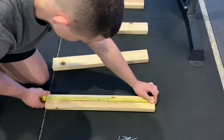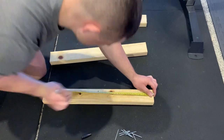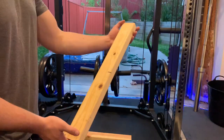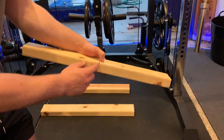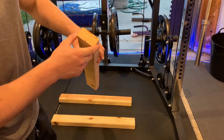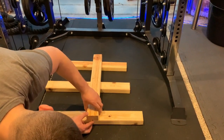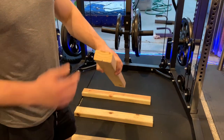So 60cm, so it'll be 30 in the middle. The way I'm marking out the middle — this is a 60cm length, so I've just marked out 30cm and put a little notch there. Same with this: this is 70mm wide, so 7cm across, so 3.5cm — that's 35mm — right here. So when we screw it, we've got to match these up, and then boom, that's the exact middle. Mark these for both sides and then we'll screw it in.